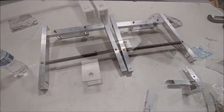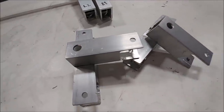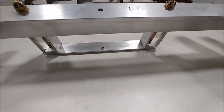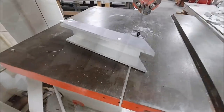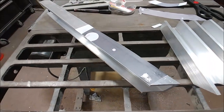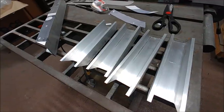Here are the left and right side upper brackets now nearly completed. These are the two pieces that make up the two bell cranks — one for each side — forming a T shape that'll be welded together. Two rods connect to the pedals and one rod goes across to the main actuator. Next I started cutting the C-channel that makes up the actual hangers for the pedals. I made good progress in the last hour and still have more to do, but by tomorrow I should have all those cut and be working on the holes and cutouts.